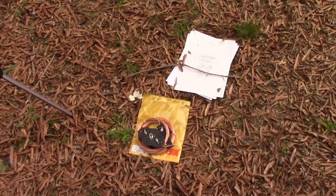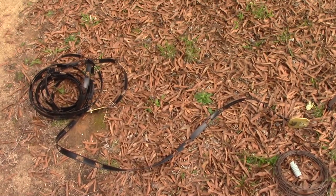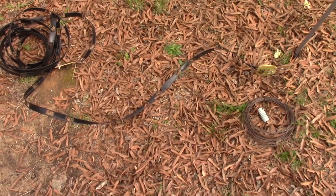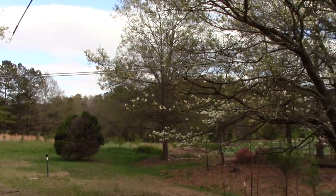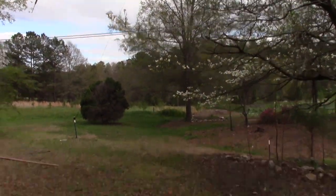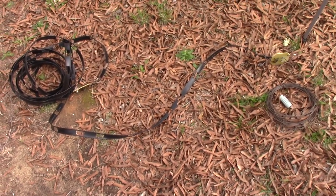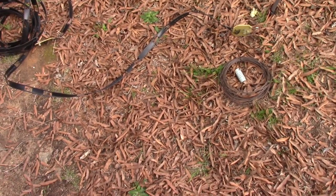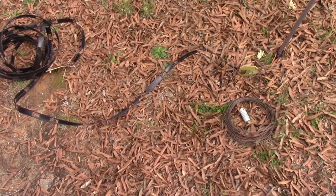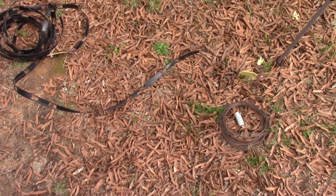So step one is to show you what I've got going on here. This is my G5RV. It used to run from my mast here by the house over to that very tall tree farther out. I have some acquaintances who call G5RVs extended dummy loads. That might be a little bit of an understatement, but it's definitely not the most effective antenna because of the 2-to-1 SWR on all the bands.